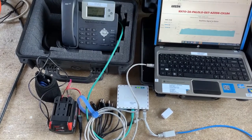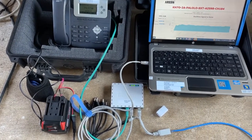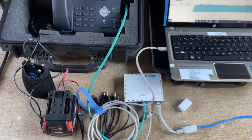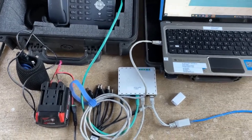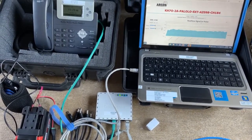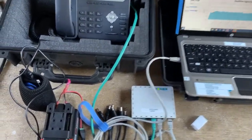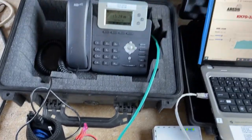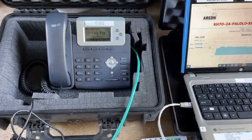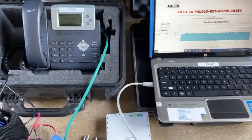Okay, here we go — short video. This is everything out of the kit: got a VoIP phone going to a HAP. The Milwaukee M18 battery is acting as the PoE for the HAP and for the LHG microwave antenna. The USB power bank is 5 volts and that's what's powering the phone. The phone is very low amperage — 0.2 amps.